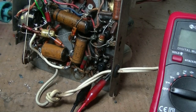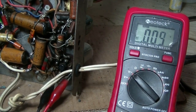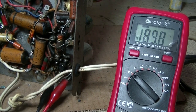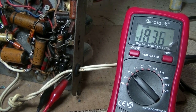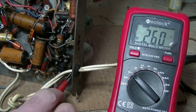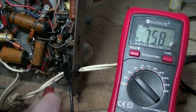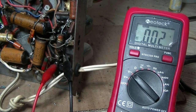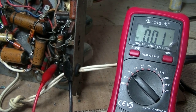That's on. We'll go directly to the plates, go to AC, give it a little bit of power — and hopefully it's alive. Yeah, that's pretty good! I can see a dial light lighting up too. The only thing I want to check is that the filament is getting its power — pins 2 and 8. We should see a little bit of voltage on that. Yep, it's looking pretty good.